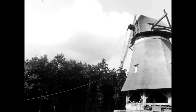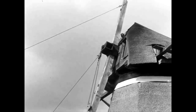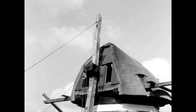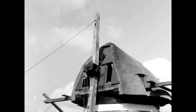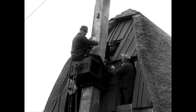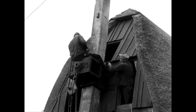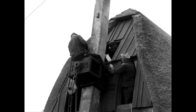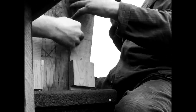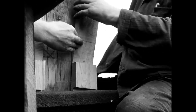The chest piece beam slowly slides through the box-like guide in the shaft head. Finally, the chest piece has reached its final position. Now the millwright must wedge it firmly in place. The millwright hammers the wooden wedges into only two sides.